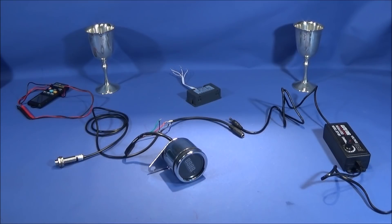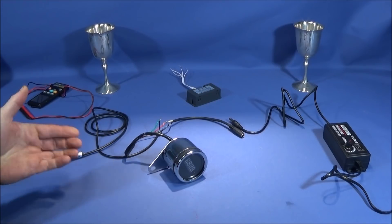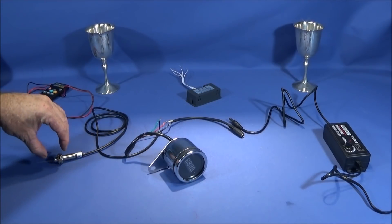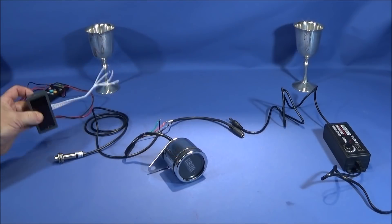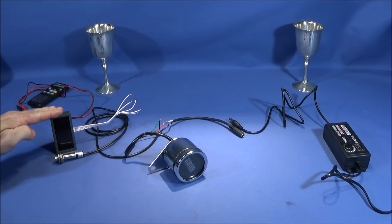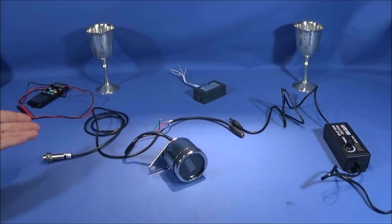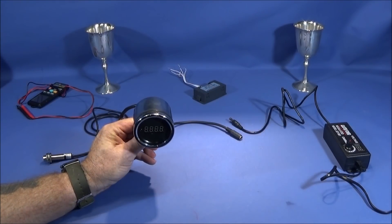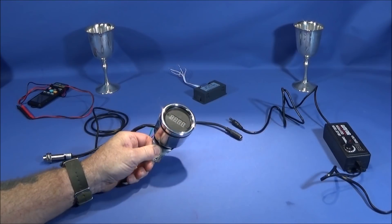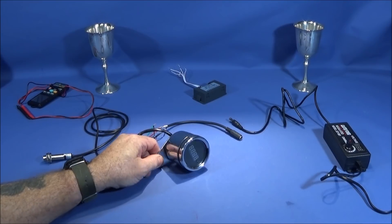The only other thing you have to buy for the tachometer is a proximity switch — they do a motorcycle one for this actual unit on the site. It's very similar to this one, a bit shorter, and I'll put a link below. I bought another set — the proximity switch and tachometer together are the same price as the motorcycle one on its own, so I thought I'd have one of those and have a spare display. Also worth mentioning: because it's a motorcycle tachometer, it's waterproof, which is great for machine use — you can use it without getting any coolant, oil or swarf into the electronics.